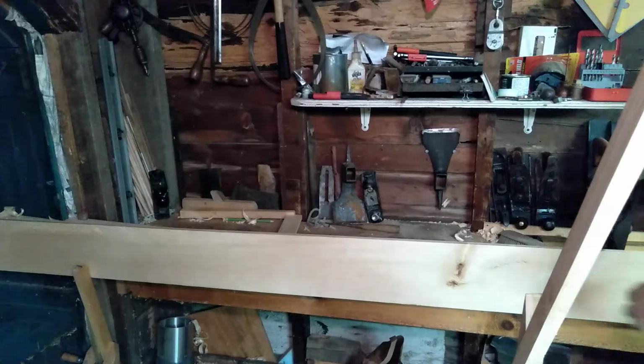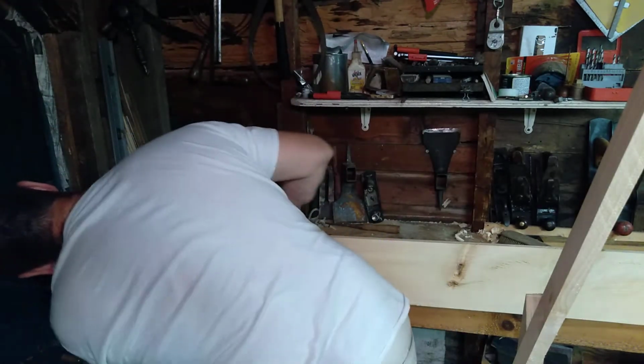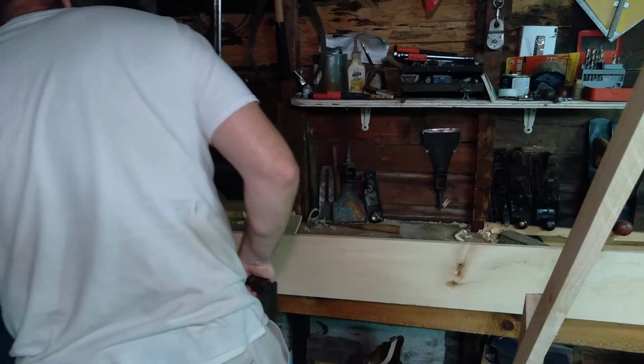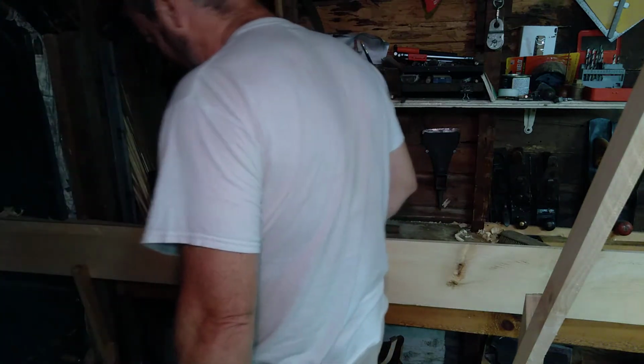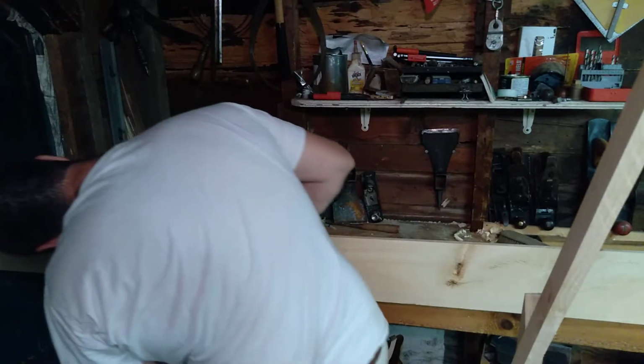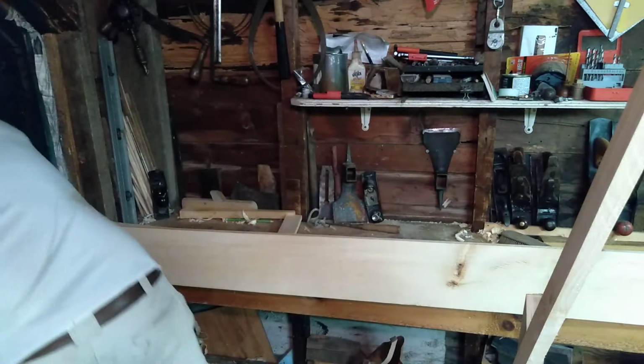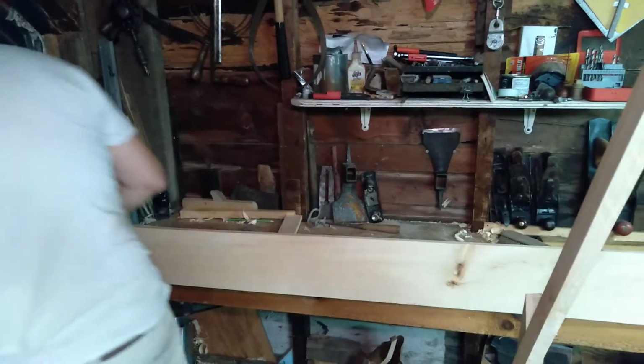What I should do is one bow bevel and then the stern bevel on that same board, then flip the board over and do the stern bevel and then the bow bevel, because I wouldn't have to keep bringing my various tools back and forth. I'll live and learn. When I build another one of these in 10-12 years, maybe I'll remember that little time-saving thought that I just had. Maybe I won't. We'll see. Lord willing, and the creeks don't rise.